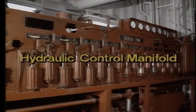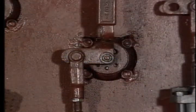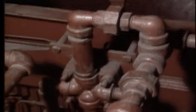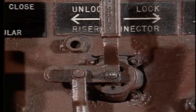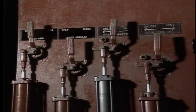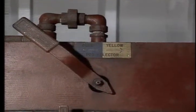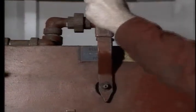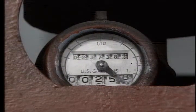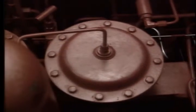The fourth system within a system is made up of the many components in the control manifold. The four-way valves: one sends main hydraulic power to the BOP stack, and the rest direct pilot fluid to valves in the subsea pods that control the BOP components, or straight through directly to the function. They're operated by two-position and three-position air cylinders. This large one-inch valve serves as the pod selector valve. This flow meter measures the flow of all hydraulic fluid going subsea through the manifold.